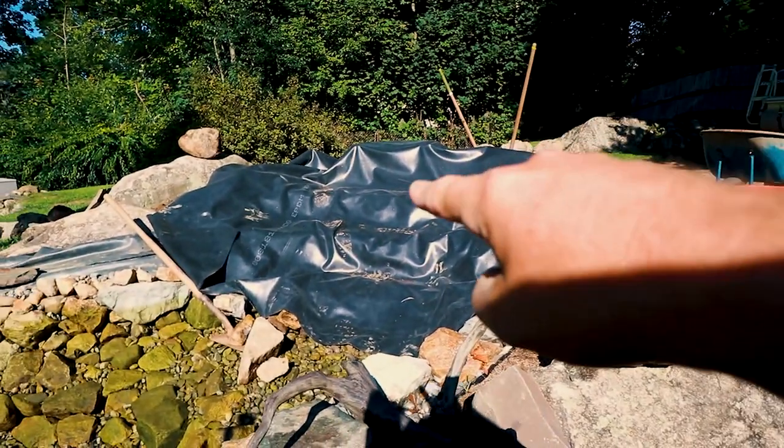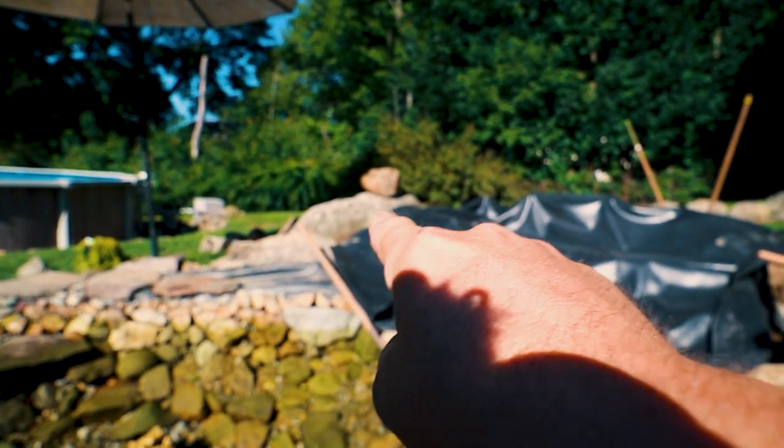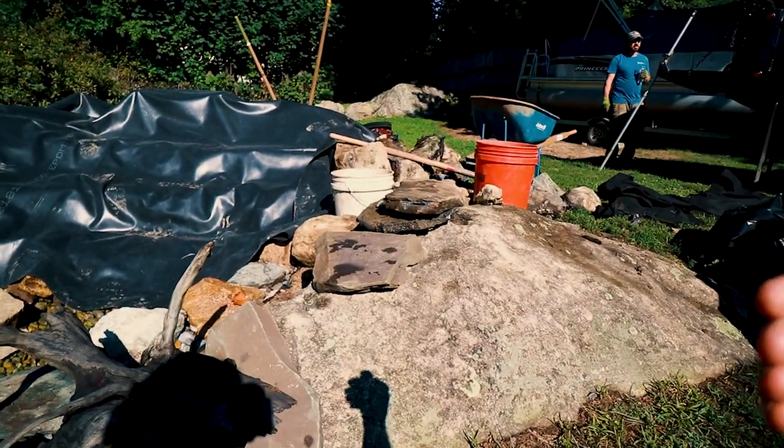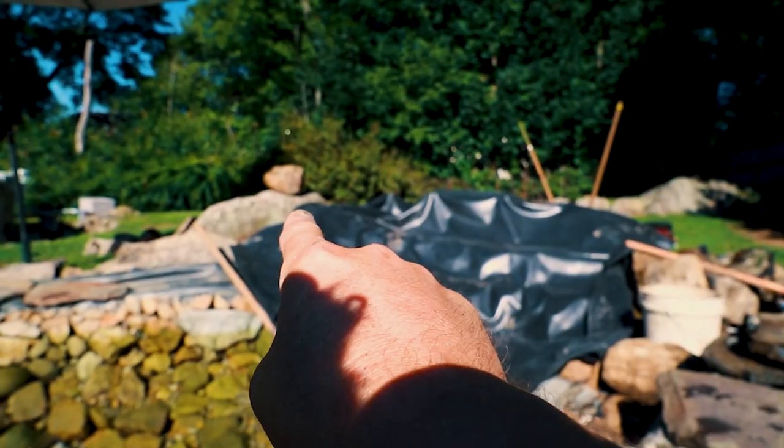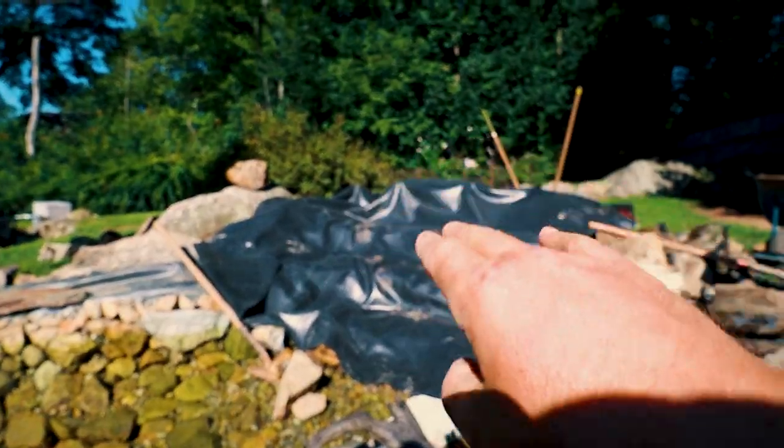The old waterfall is out. We've completely disassembled it and re-carved our ledges for the spillways. We're going to work in three spillways from the first out of the biofalls and then two more before it falls into the pond. We also lowered our biofalls by about four inches just to sink it into the ground so we can complete our rock work to blend it in with the existing landscape. They've got two very large stones in the yard that they built this pond in between. New liner is in. The hump up at the top is our biofalls. We're going to redo all the rock work from over there up to and around the biofalls so it looks like one giant rock formation that's coming in and the water is spilling through it.